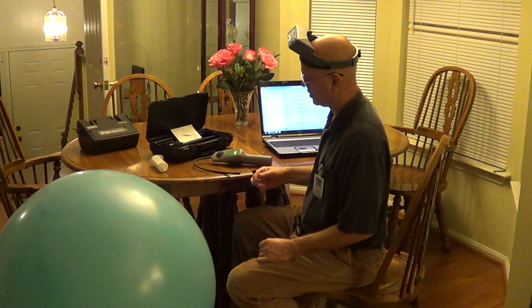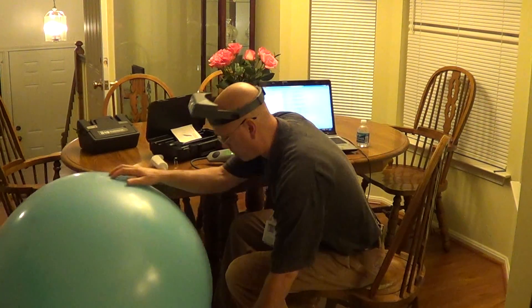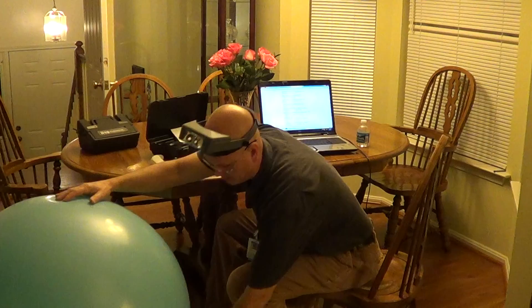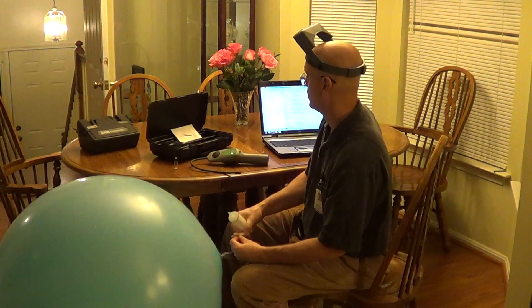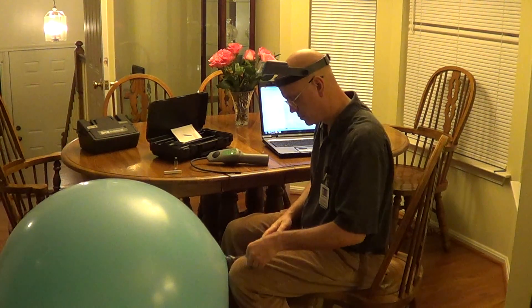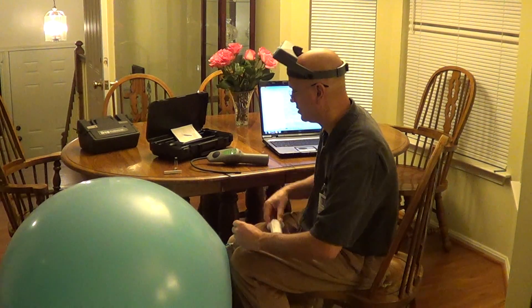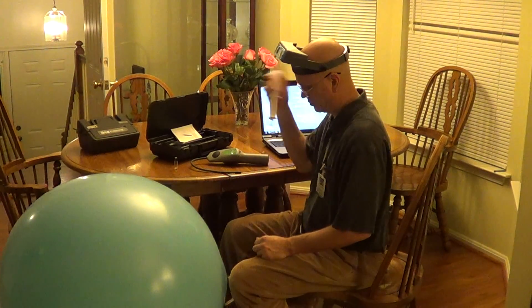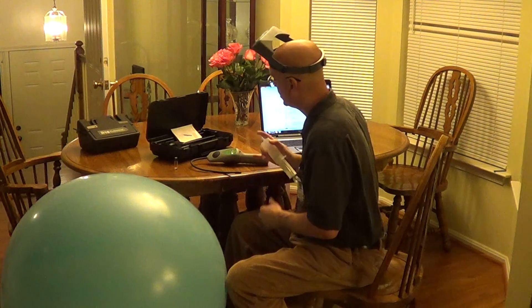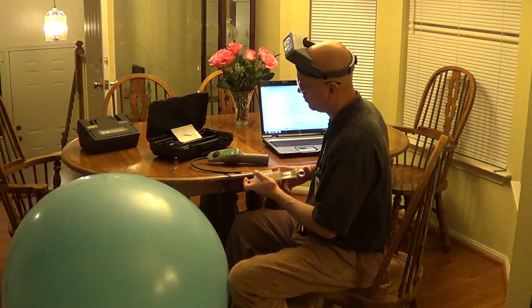On the reference leak here, it picks up about a quarter inch away, which is even better than what the H10 will do. So I'm curious what this does with R22 — it's probably quite sensitive to R22. I'm going to start off at one part per million, do 10cc, then 100cc. One part per million, sensitivity on high. You can see it quite easily picks it up, and it also picks it up very fast.